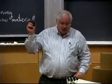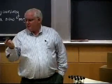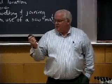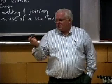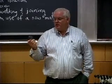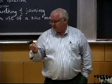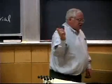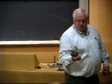This is just a piece of HY80 steel from General Dynamics Electric Boat. Just a test plate. HY80 is 80 KSI yield strength, and they now use 100 KSI yield strength steel, and they were going to go to 130 KSI yield strength steel until they ran into problems with the Seawolf submarine. So that's just an arc weld in a heavy piece of steel. You can see the heat affected zone etched on the side.